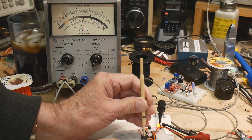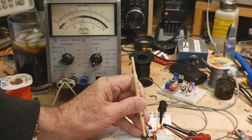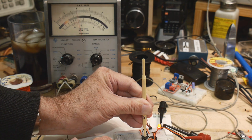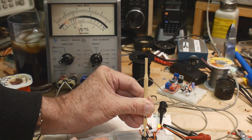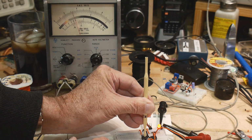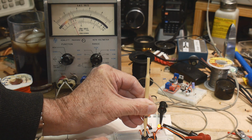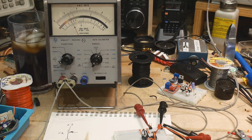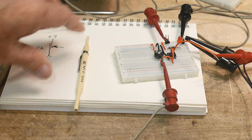So now I can go back the other way. And get my screwdriver in there. All right, I'm going to come back down. Going to go slow. We're down about 3 volts right here. We'll keep going, and there it goes. It just turned off right at 2.5 volts. Perfect. Okay, so you've probably never used that before, I'm guessing. I never have.